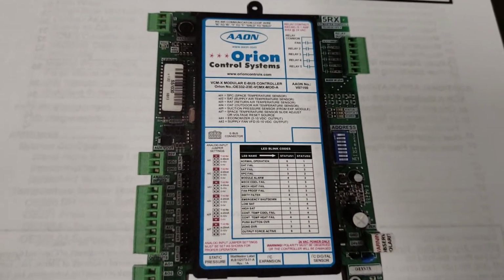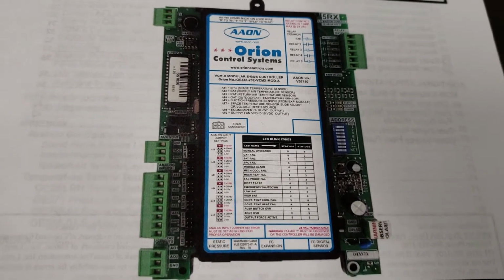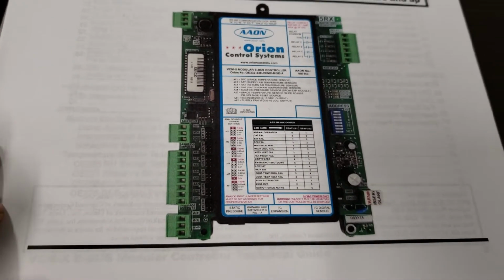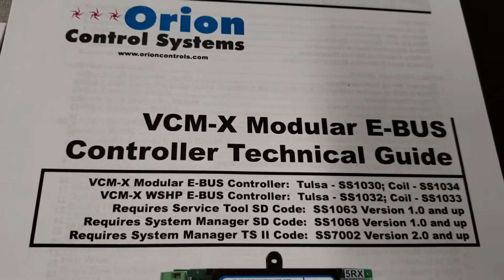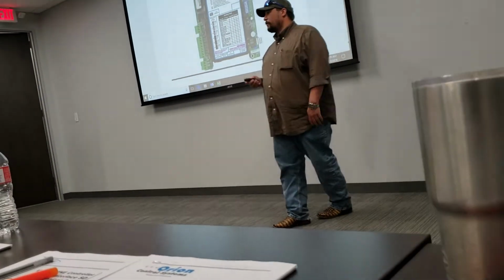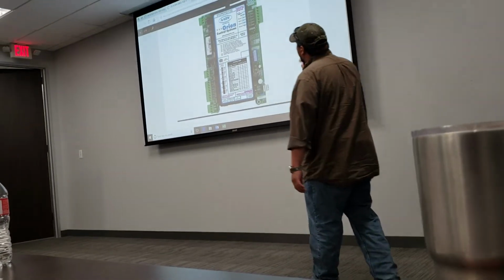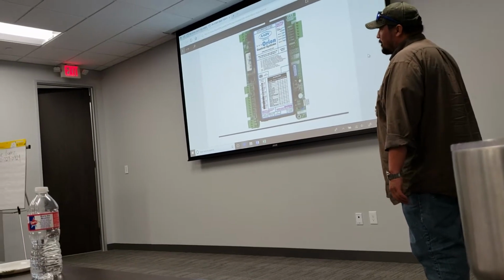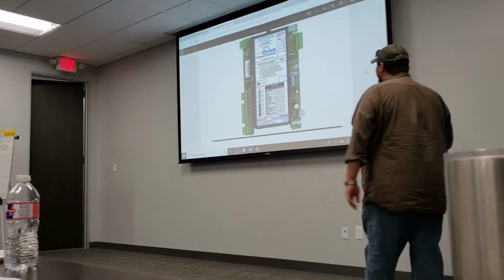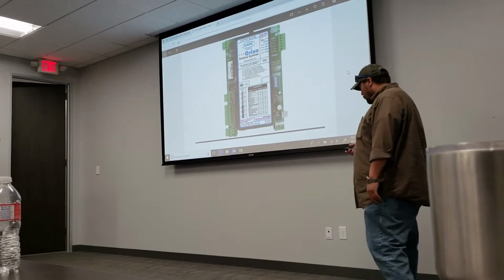I had a guy some years back, actually, it was wired from the factory incorrectly. They basically took this plug and turned it upside down, plugged it in from the factory. And my guy went and changed the board out. After 3 boards, realized, hey guy, you're doing it exactly the same. All you've got to do is swap two wires. So we burned a lot of boards then.